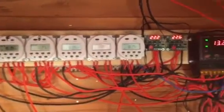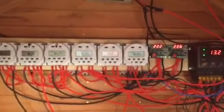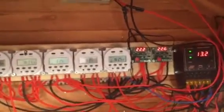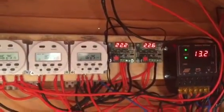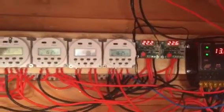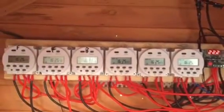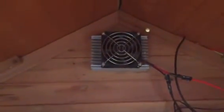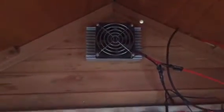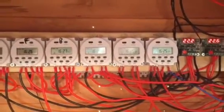The next one, number four, is connected to the first thermostat. As you can see the temperature is about 22.2 on the first one and 22.6 on the second. If that gets down under 15 degrees, and the timer is on between 12 and 4 during the day, it'll make the reverse peltier run and warm the interior.